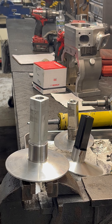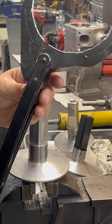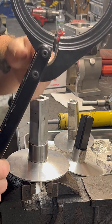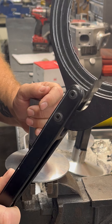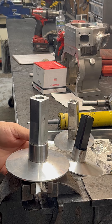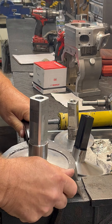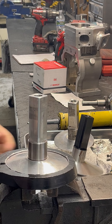One of the ways is to buy yourself a spanner wrench like this. This one was made by Motivational Tubing. I know that Todd Shaw at TRS used to make them, I don't know if he still does. But you get one of these spanner wrenches, you build yourself a tool to hold it. Take your spanner wrench, go right on the top of the sheave like this, and give her a pull — and as you see, it broke loose.